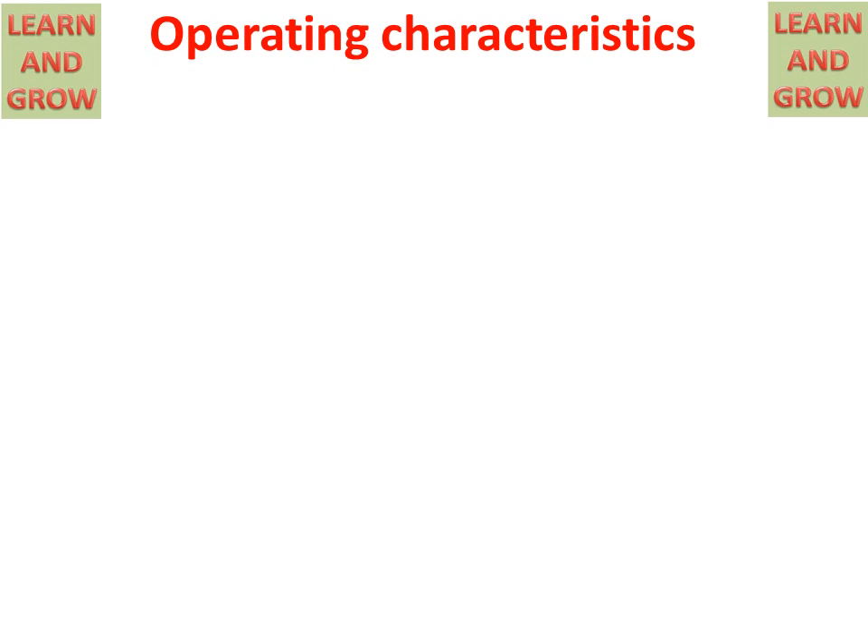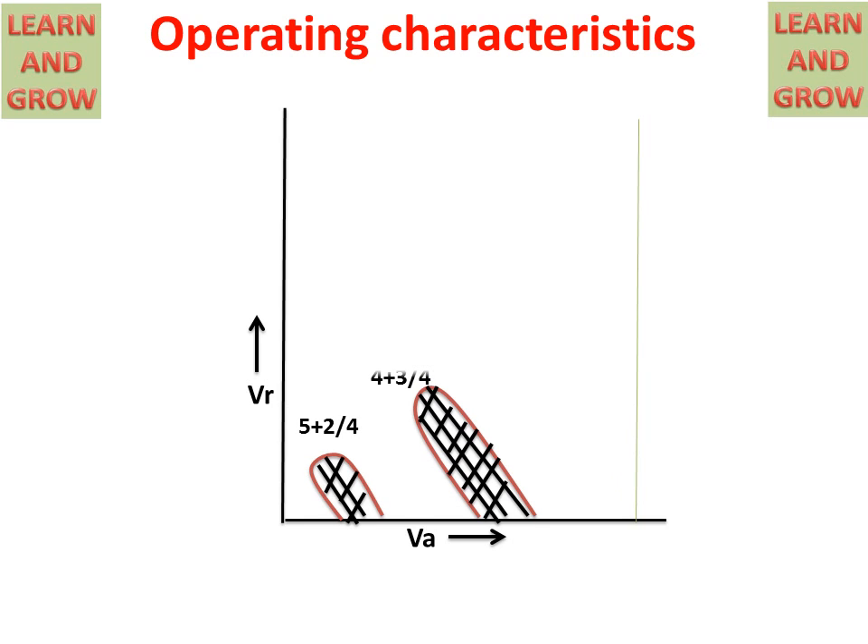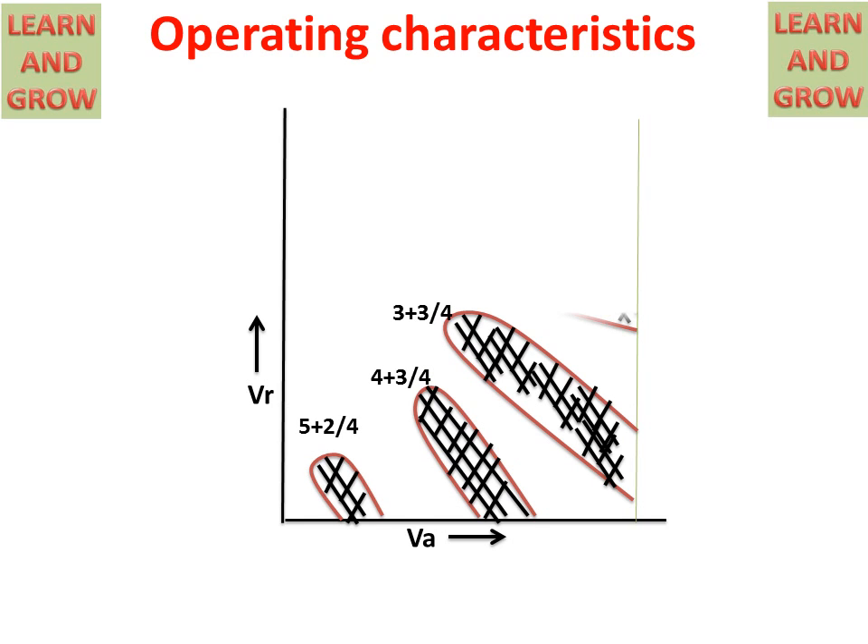If we talk about the operating characteristics, which is drawn between repeller voltage and anode voltage: the earlier the mode, the larger the output power, which is an advantage. But the voltage required is also higher, leading to insulation problems and the possibility of low efficiency. Each mode corresponds to a specific operating region, as shown by the operating characteristics curve.